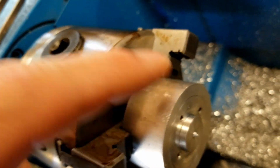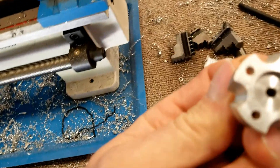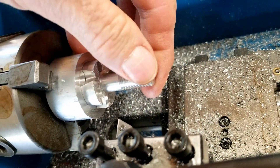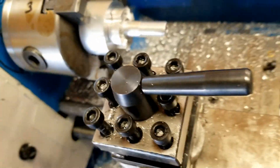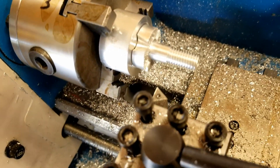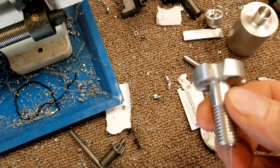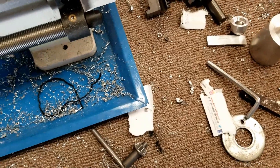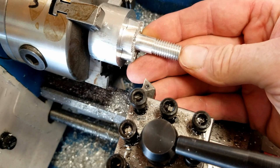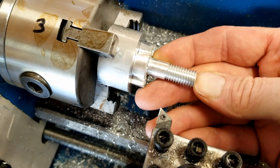What you do is mount this device — this is just a slug — into the lathe. You turn this hub, which is going to fit exactly with the back end of this piece right here. Since you just turned this piece in the lathe, you're not letting it go. You transfer your holes, drill and tap it right while it's on the lathe — just small holes, you can get away with that. You pull this part off, and that's what you use the old prop adapter for: to transfer those holes through. Then you bolt the new piece right on, and now everything you turn out here, including this bearing bore, has to be square, perpendicular, and concentric with the bores on the back side of this part. And that is how that's done.